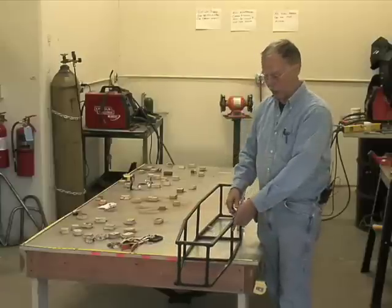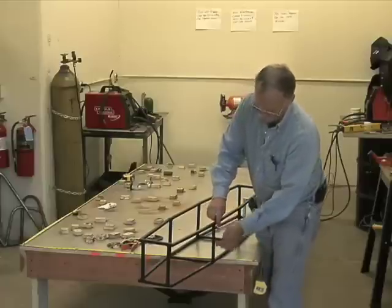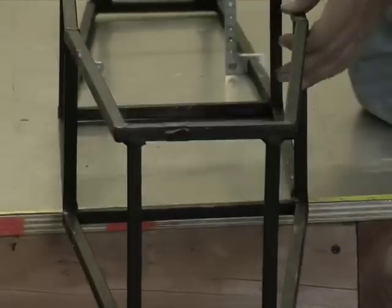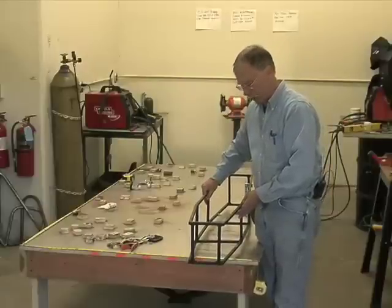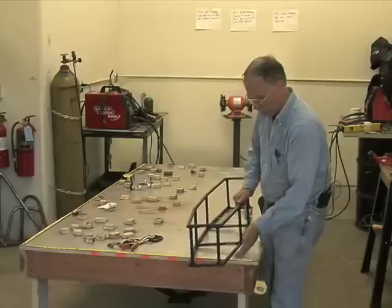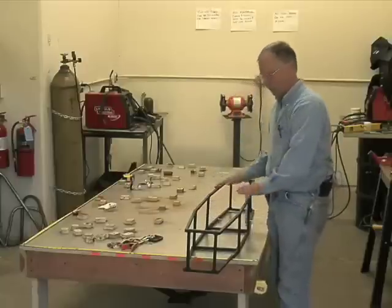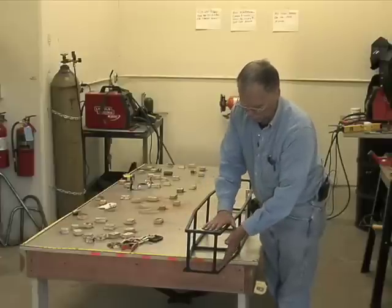Now, we could cut out sheet metal panels, then go from here, see this cross member here, to here, and attach them with screws. Same way on the bottom, we would definitely do that because on the bottom, you want to keep it as flat as possible. You don't want any kind of curves on the bottom. You want to keep it flat. But on the sides, you might want something more than just flat metal, flat metal, flat metal. It would look faceted, meaning just flat planes.